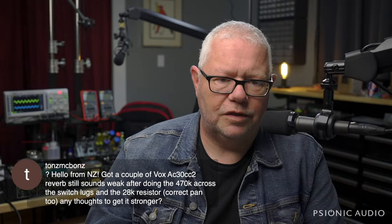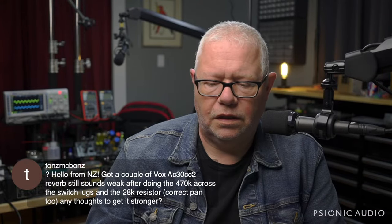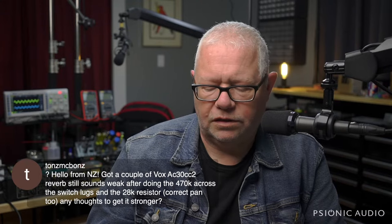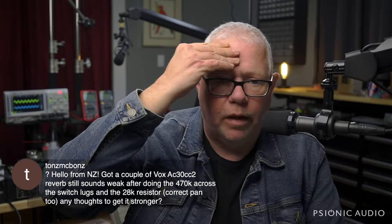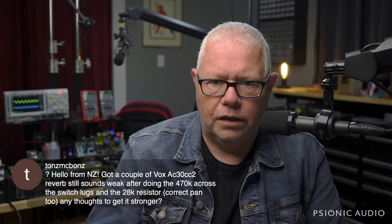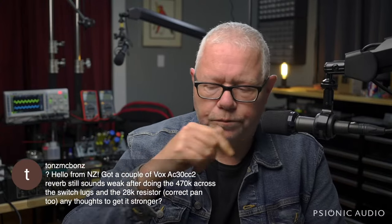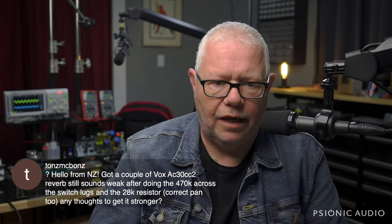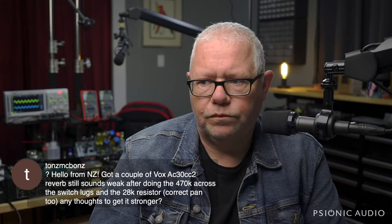But the reverb on the Custom Classic has always sucked. As far as getting it stronger, it's fairly easily done. You want to look at the negative feedback loop on the op amp that's used for the recovery gain, and say it's a 220K, try 360K or 470K in that feedback loop. And that's how you adjust the gain in that. It's fairly easily done, but given the